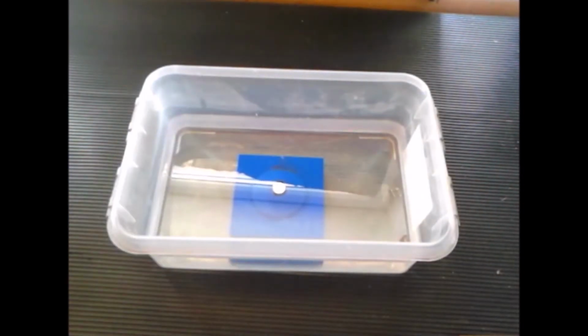We usually used tap water. The temperature was held constant at around 20 degrees Celsius plus minus 1 degree. We also tested in distilled water, seawater, acids and other liquids. The used liquid has a big influence on the final erosion, since chemical effects will overlap with pure cavitational effects.